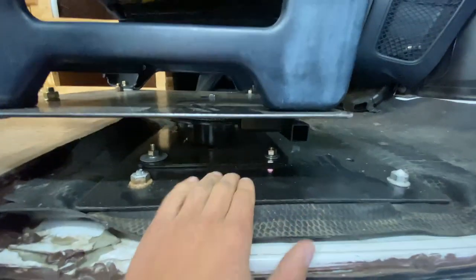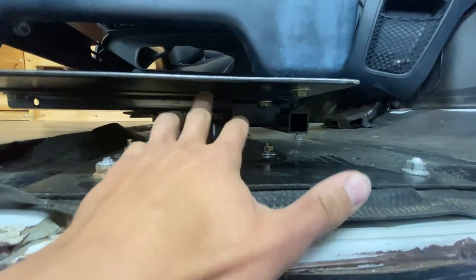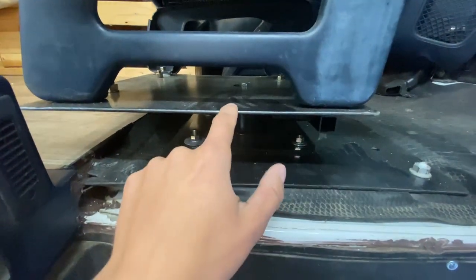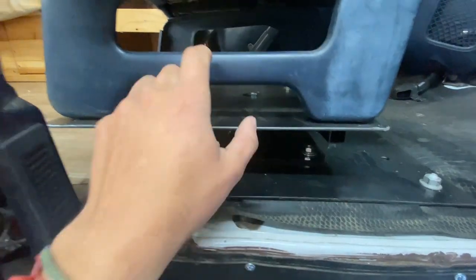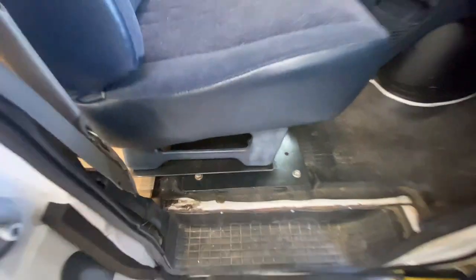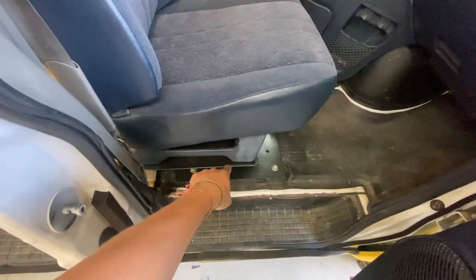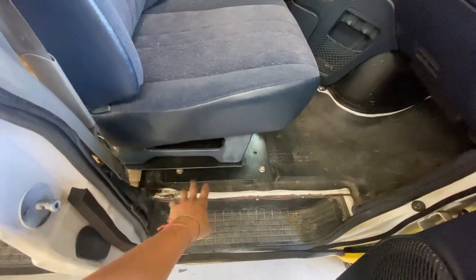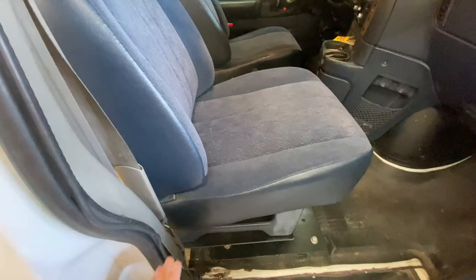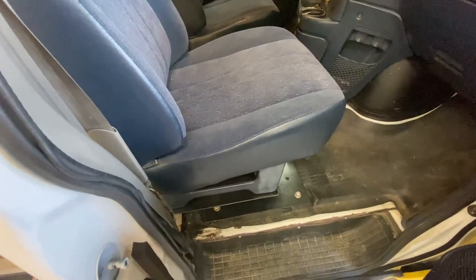Then I had to adapt to another plate of metal to put the chair on. I drilled holes to match the swivel, bolted it on, positioned the chair where I wanted it, drilled holes, and bolted the chair down. Pretty self-explanatory — actually pretty simple. You'll need one plate of metal, a second plate of metal, a swivel, some bolts, and a chair. The first step is going to be grinding these pieces of metal down and getting them ready to paint.